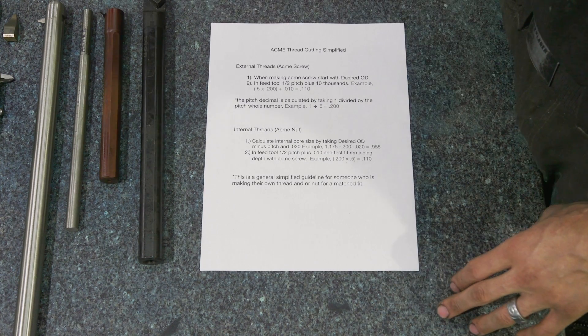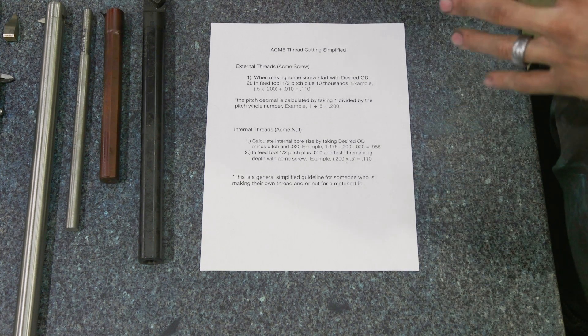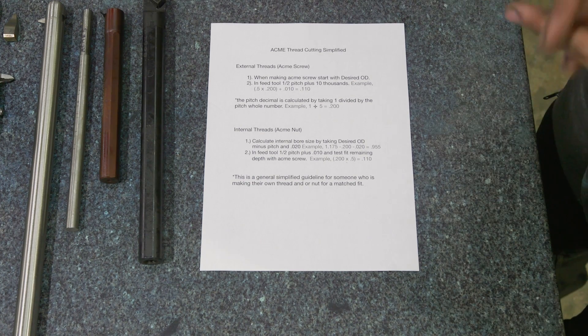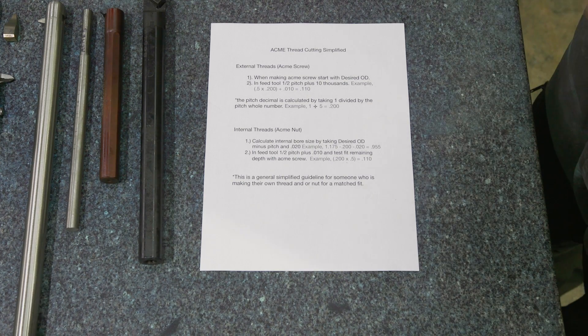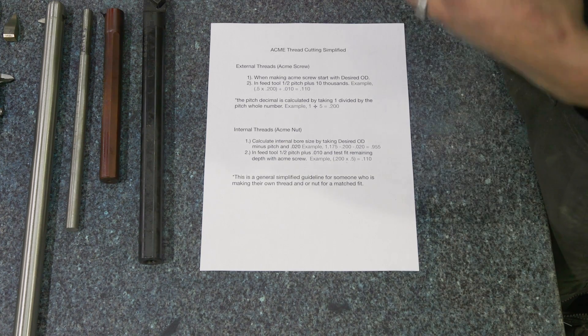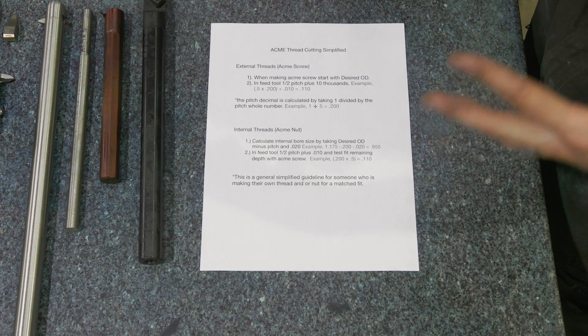The other document I'll talk about more specifically is Acme threading, which is what we're focusing on, and how to size your Acme threads both external and internal. Abom has a really nice older video where he breaks this down, and just like I am here, it's a simplified method for making quick threads where you're not trying to meet an ANSI specification. What matters more is the fit together — not hitting a certain number with a thread wire — but how the thread functions in real life, without getting bogged down in all these parameters.